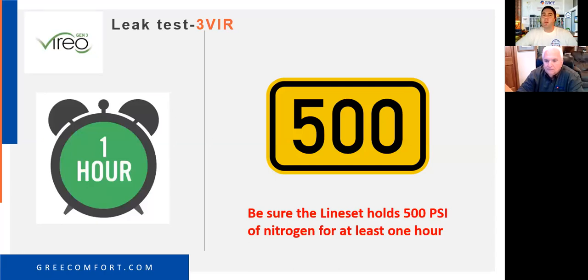And so once we've got all our wiring and everything installed, we've made our proper torque on our flares, we want to do a leak test. We want to make sure that you've got a nitrogen regulator that goes up to at least 500 psi. These systems, the high pressure switch isn't going to cut off until about 610 psi. So we're safe to put 500 psi of nitrogen on that system, let it sit for an hour and make sure that it doesn't drop. And what I normally do is I'll grab my bubbles and I'll soak my joints just to make sure while that pressure is on there.